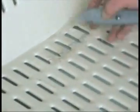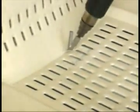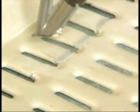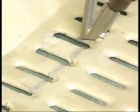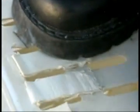After the welding process is completed, trim away all excess pieces. It is of utmost importance that the inside surface of the bin is smooth. Sand away all rough edges and smooth the final surface with the welding gun. When the whole process is complete, test the area to make sure that an effective repair has been done.